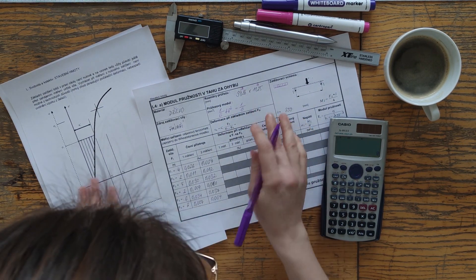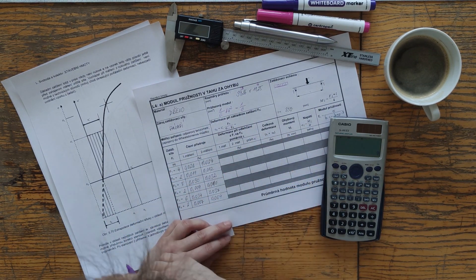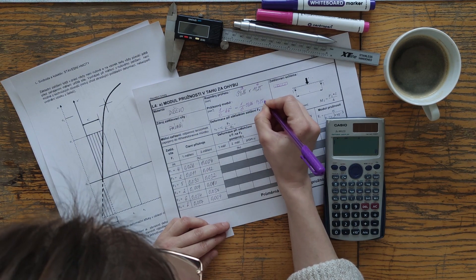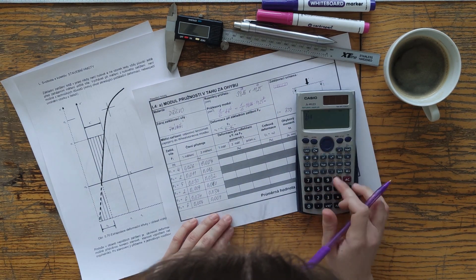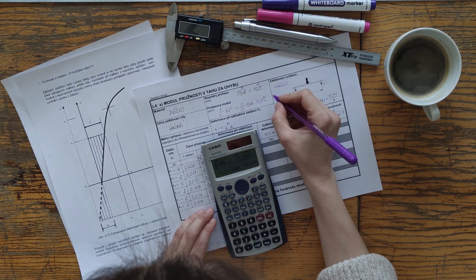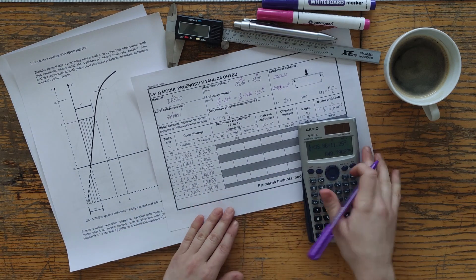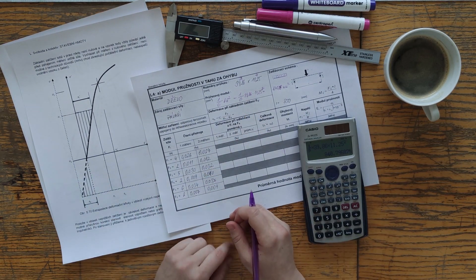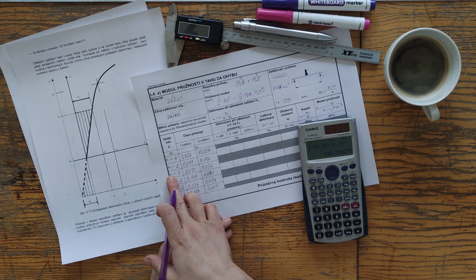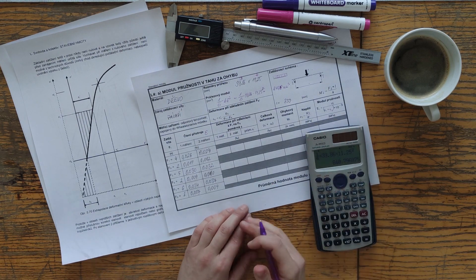We fill in the formula. We will calculate in millimeters, because for the bending moment we will use Newtons and millimeters. We enter the formula into the calculator. Ideally we manage to fill in all indices and numbers. We will return to this part, which needs some explanation — specifically how we correct to zero, since we were using a so-called zero loading force of 2 N. From the instrument reading we obtained the so-called strain (přetvoření), which we will need for further calculations.